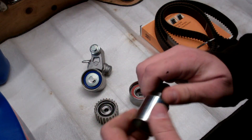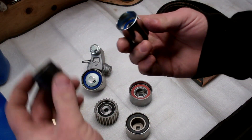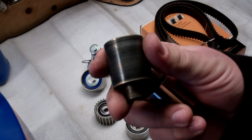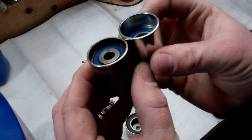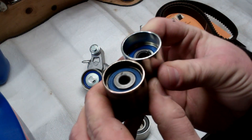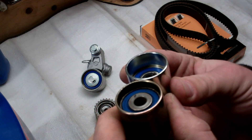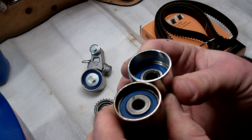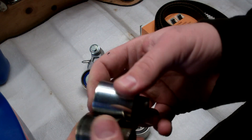Now with the small idler that we have — the updated idler — it's the exact same part number as the old one. However, with the old one you're going to need a shorter bolt. If you can see the depth difference inside, you're going to have about 10mm difference on the bolt. So you'll need to find a slightly shorter bolt by about 10mm, or maybe you can hacksaw your old one shorter. That's what I recommend for it to fit right.